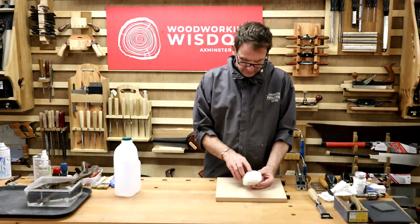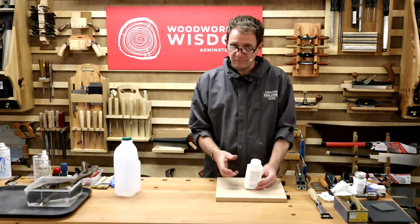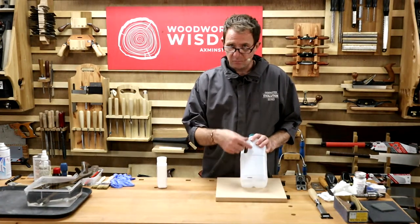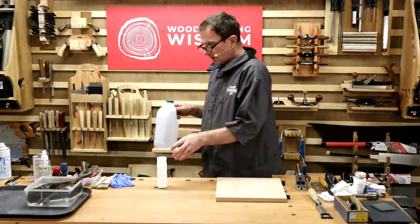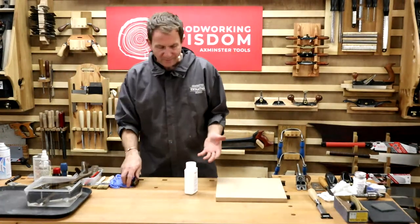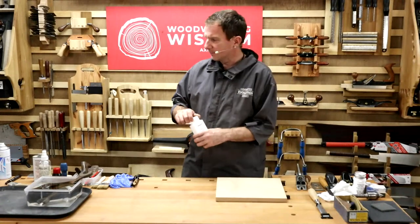Really? Okay. It's economical. The contents of this little bottle, 250ml, will make 5 litres. So on my milk carton, I have a black line down here that told me that's 100ml for my 2 litres. So, okay, I've worked out my percentage. Really easy to do. Put it in there, let it soak, we'll see what it does. So a nice component to try and use, see if it's going to take the rust off. Just that surface area I want to clean up.